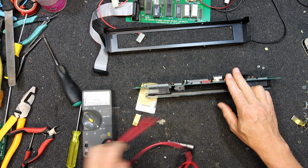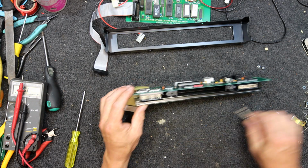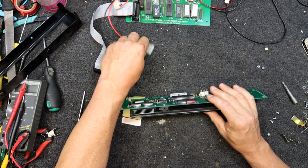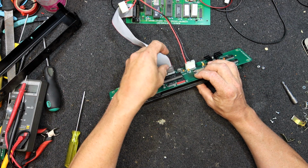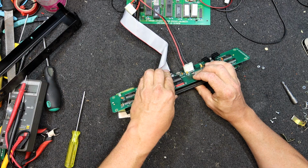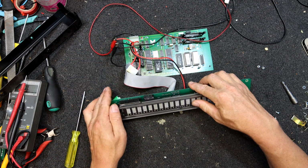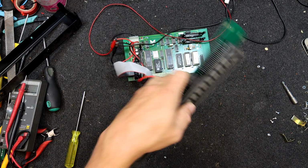I guess at least we can check if that voltage looks about right. Because if we get a low filament voltage or a low 30 volts or whatever they run off, that'll be enough to upset them, but chances are this is just old and high hours. But I think we should at least check, because it would have been nice to have these if the displays were good.